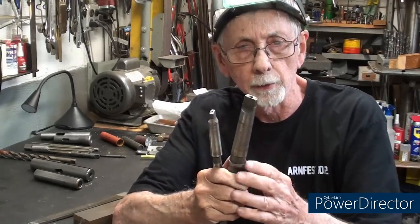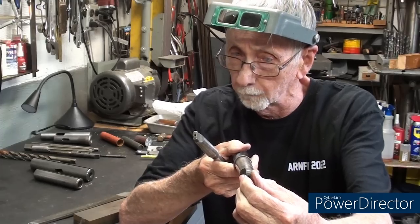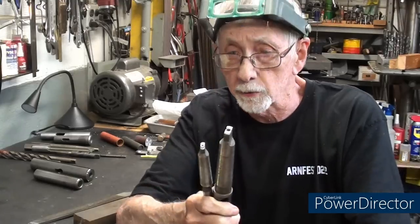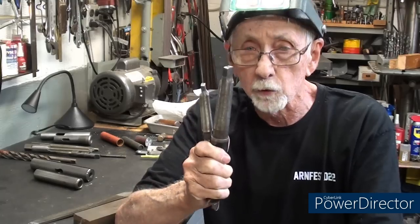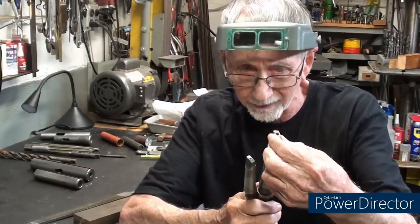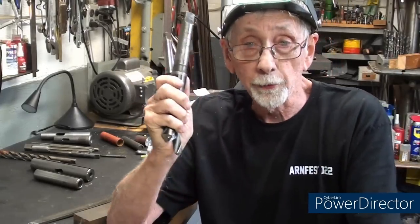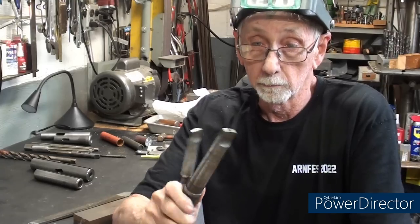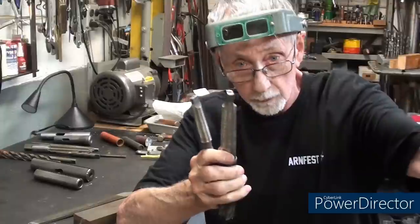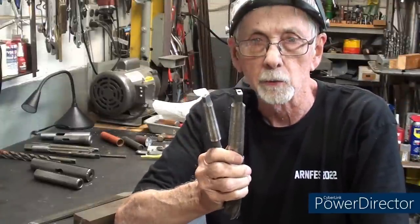Let's toss this around a little bit more. I still think that the purpose of the tang is to keep the drill from rotating in the quills. Many old-time machinists said they've been in the business for 40 or 50 years and never heard that — that the purpose of the tang is simply to eject it out of the quill. I just assumed that's what it was for, to drive the drill. So the jury is out, but let's toss some of these ideas around.